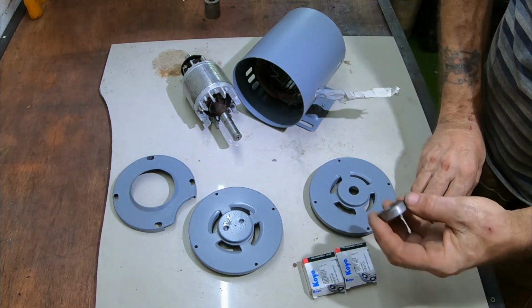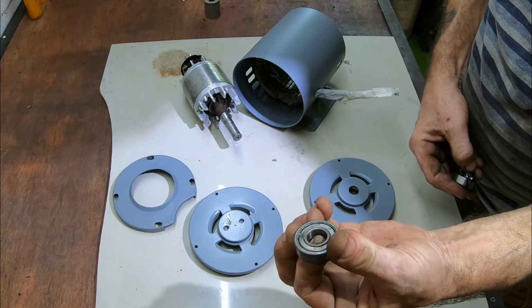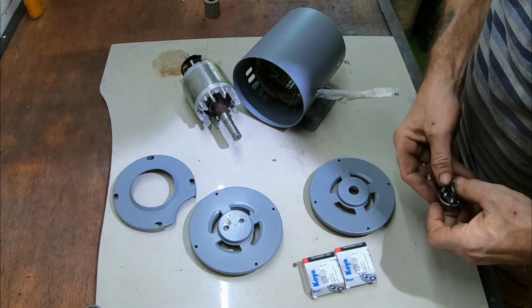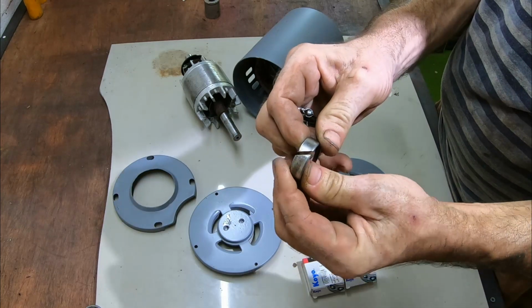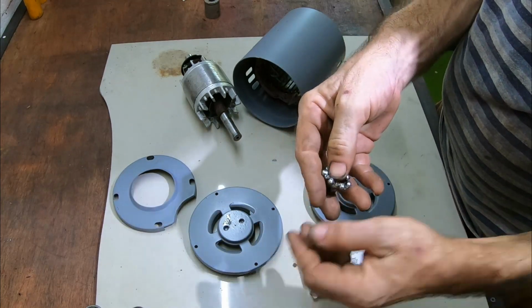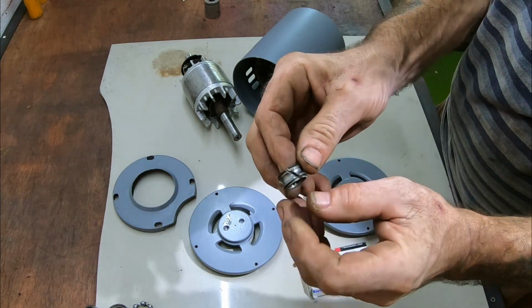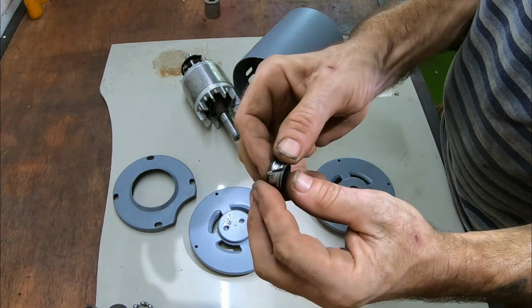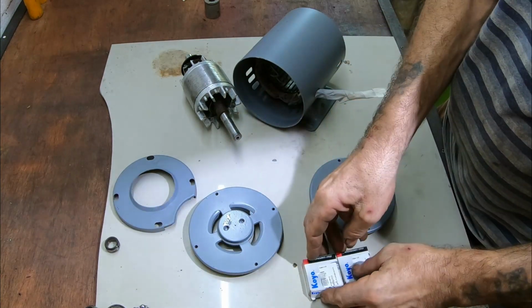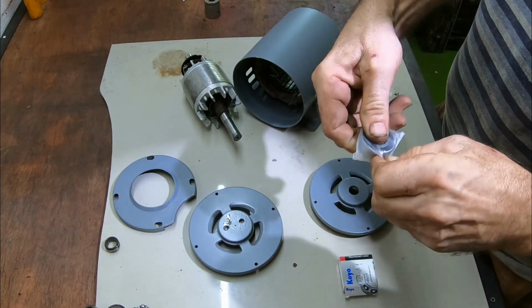Anyway, first bearing came out, as you know, rusty as hell, grindy as hell, scrap. Second bearing wouldn't come off, so I actually cut it off with a grinder, took the outer race off. Bearings came out and I had to slightly touch the shaft in cutting the inner race off, but it came off okay. So yeah, got 2 new sets of bearings.